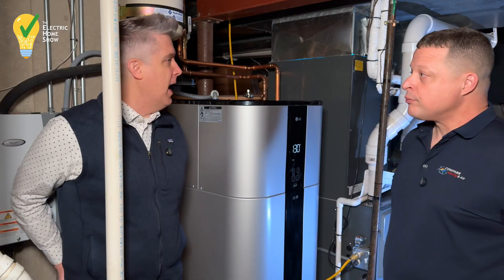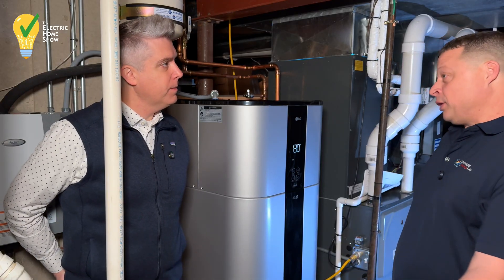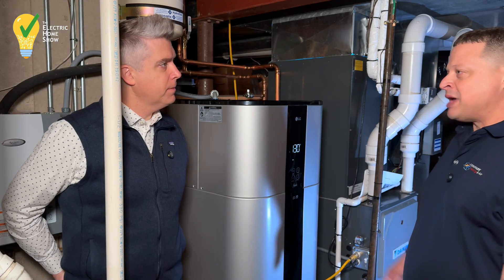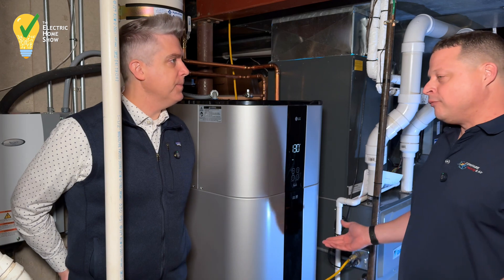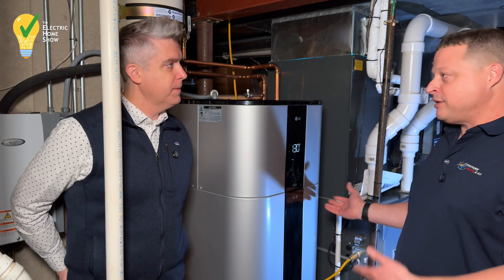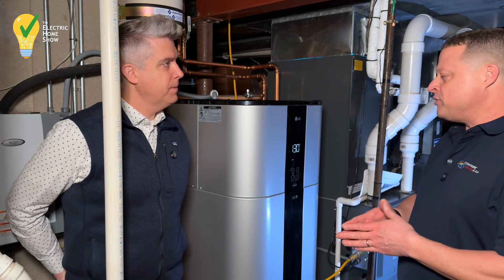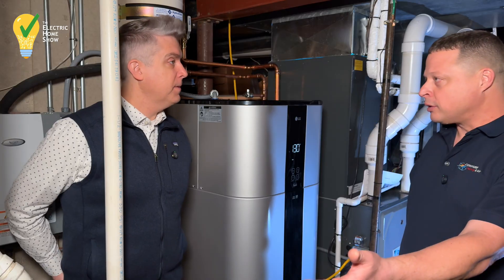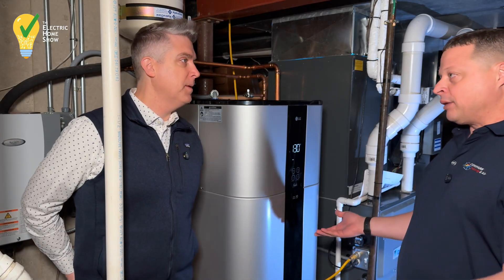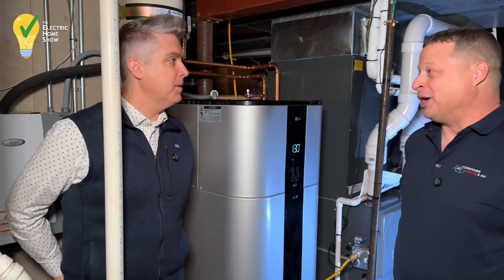It can clearly be done without it. But also, having water stored at a warmer temperature does use more energy. With the idea that it wasn't a need for us — I think if you had a water heater and you added another bathroom onto the house or something, then I would look at it. But the 58 gallon at 130, producing 72 gallons in an hour, is not really an issue.